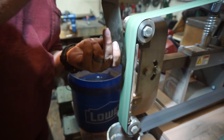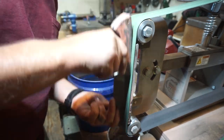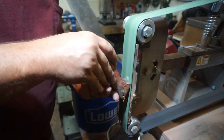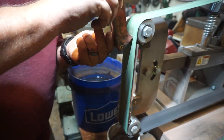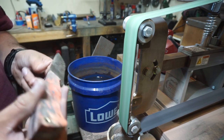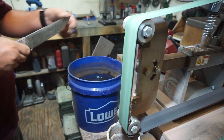We're going to go ahead and take a 120 grit belt and get rid of some of the grinding lines that we put in from that 40 grit belt and get ourselves a nice smooth spine, to make sure that we're making the work easier on ourselves later whenever we start hand sanding.